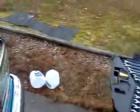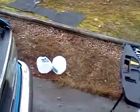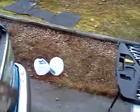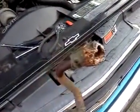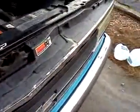Okay, this is an original heater hose that came on the truck, and that broken fitting right there, which lives right there next to the distributor. See that right there? Yeah, you're right. I've been feeding it for a while, and I thought it was the rear core plugs giving me the problem. But fortunately, it's Sunday, and I've got time, so we're going to fix this.